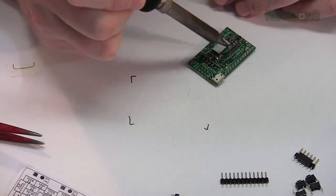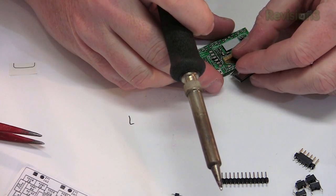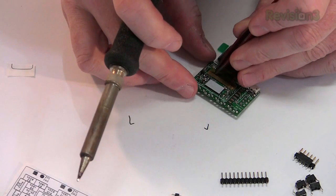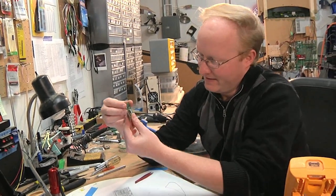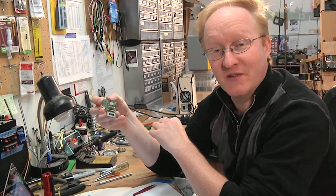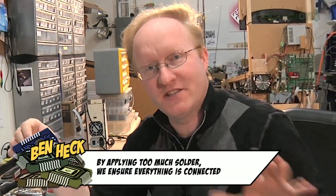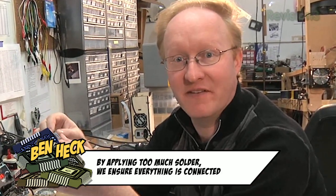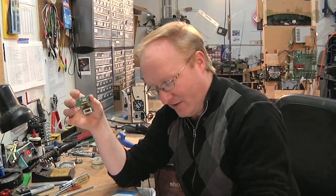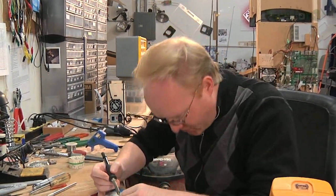I've pre-tinned all the OLED screen contacts — it's copper, so it should connect well. I've never actually attached one like this before. I have the screen in place and most of the electronics done, though I did run into a snag: I had a short when I wired up the screen. The regulator got really hot, so I used a multimeter to check the three-volt line, which had only about half an ohm of resistance to ground — confirming a short. I went over the connections again, made sure they weren't touching, and that resolved it. The final step is to put on the headers and switches.